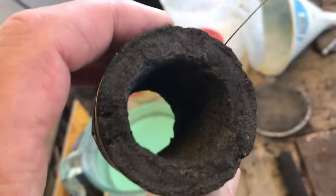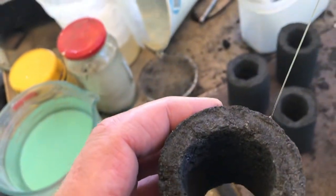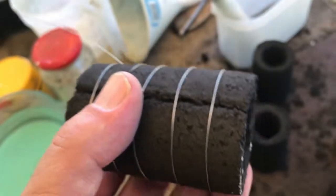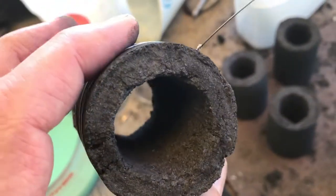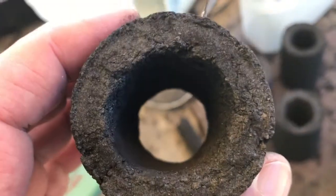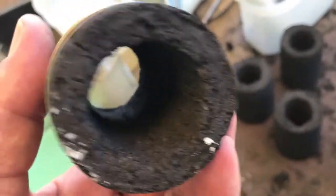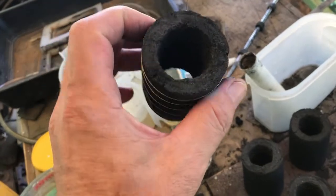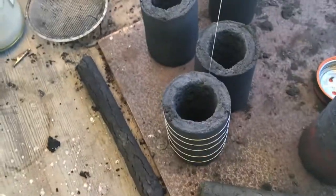So I'll mix up some zinc acetate this time instead of zinc sulfate, and see if we can get a better plating. I'll use vinegar and some zinc metal and plate that completely. I'll have to stick some zinc down the middle as an electrode to plate the inside, because it probably won't plate in this electrolysis-like way. So I'll get that going and I'll get back.